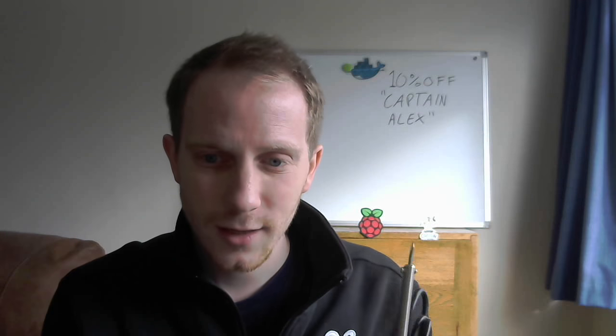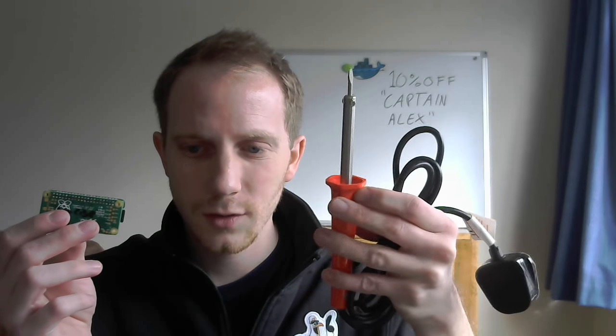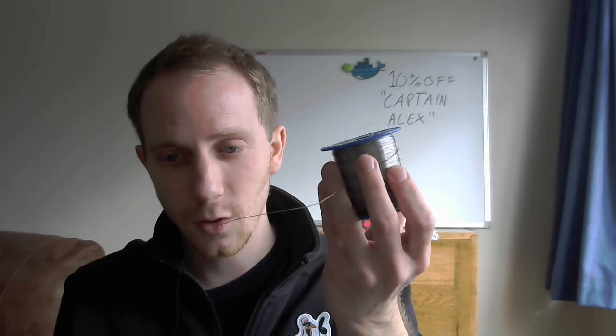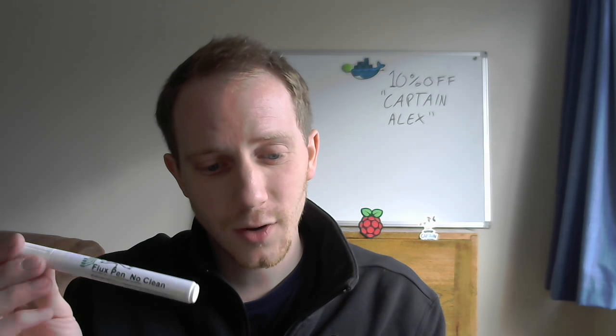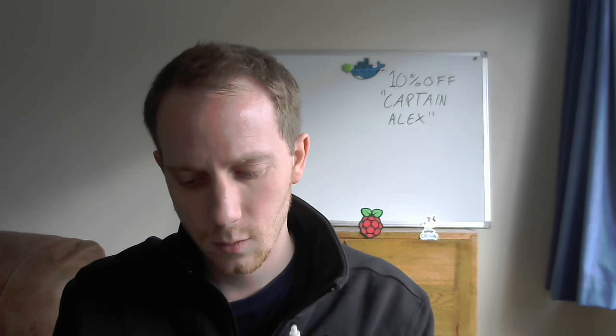First I want to share a couple of tips around soldering. Once you've attached your pins to your Raspberry Pi, you use a soldering iron to make each joint permanent. This is the kind of solder that I buy, which is a 50-50 mix of lead and tin. If you want to make your joints really solid and durable, the thing that I find really helps is a flux pen. Flux is a liquid which you apply to each joint before heating it up, and it helps the solder join really well.